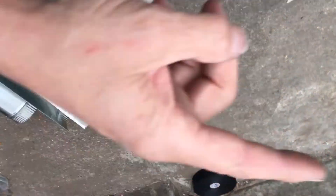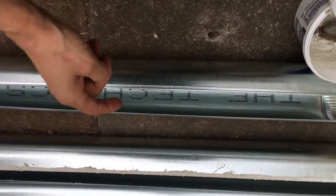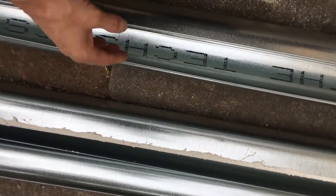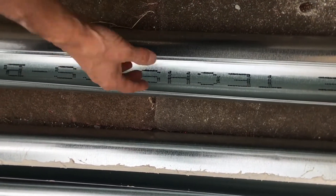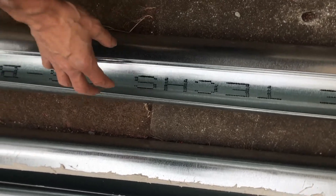This system had four 90-degree bends on it with flex duct that was sagging underneath the house. That's what caused the old burner on the old system to burn out. And it would take two to two-and-a-half hours to dry clothes. The energy bill was astronomical just trying to dry clothes through that.